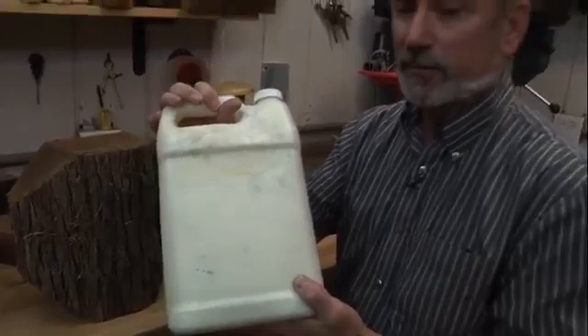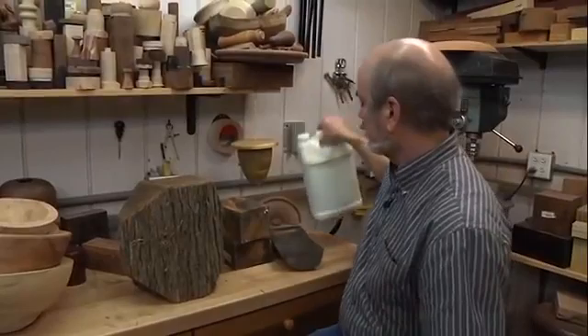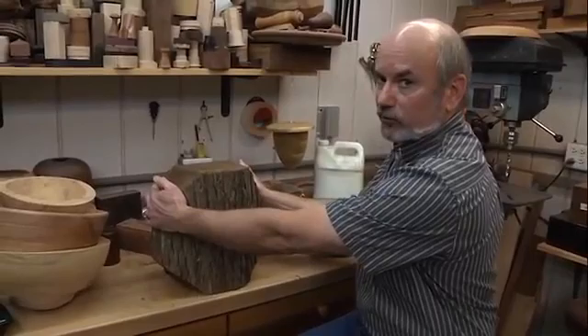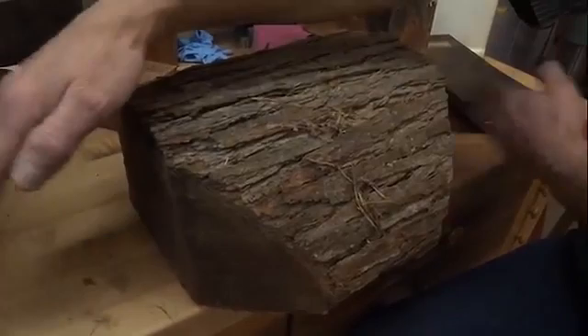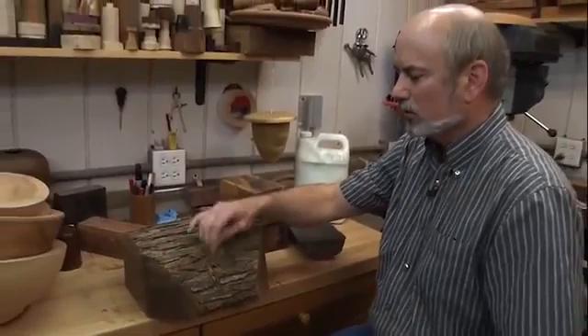It's so important — imagine this was a round log in my yard. The first thing I want to do is seal the ends, because that's where the straw openings are. If you keep a log like that in the shade, it should work for a few months without cracking. Put it out in the sun and it'll crack pretty fast no matter what you seal it with. I like to prep my wood a bit further ahead than that.